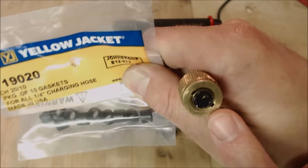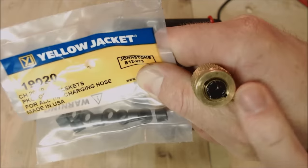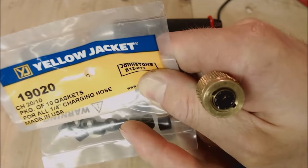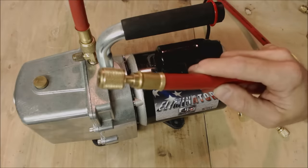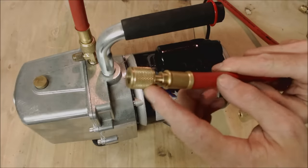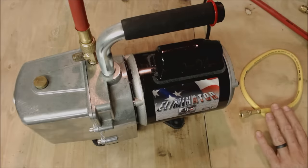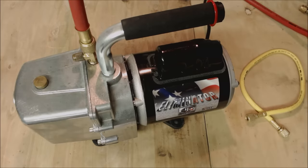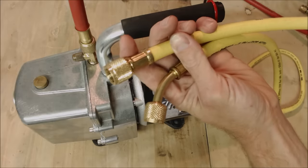Tip seven: when you have your grommets getting worn down over time, don't just keep trying to tighten the nut and force a vacuum — go ahead and replace them with new ones. I have these linked in the description below. Tip eight: you want to use larger diameter vacuum hoses even if you have to reduce down when you go through a transition such as at the valve core removal tool. You could also use shorter hoses, such as this quarter inch by quarter inch hose. And if you are vacuuming through a four-port manifold gauge set, you would use a 3/8 hose.